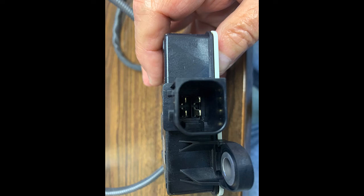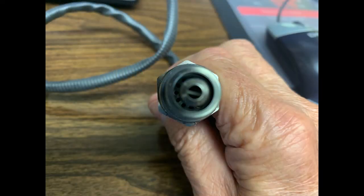There's the plug — you can see there are four pins: data plus, data minus, ground, and power feed. Here's a look down into the end of the sensor. It's got a heating element to clean itself, and that's about it. We haven't had really any problems with these at all — I don't think we've had any fail. You're going to find them on 2018 and newer equipment; older than that, you probably won't see this sensor. Thanks for joining me. See you next time on Neural Splendor.